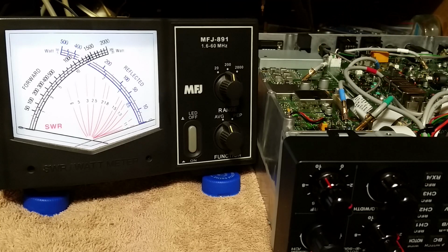So I'm going to run it down to flat frequency right there. Hear that? Now we're going to slowly bring her up to zero beat. Right there. Zero beat. And the audio is right on the money. And the radio is showing 510. It should be 500. So I'm not going to bother trying to set the reference crystal in it, because it seems to drift every couple minutes.